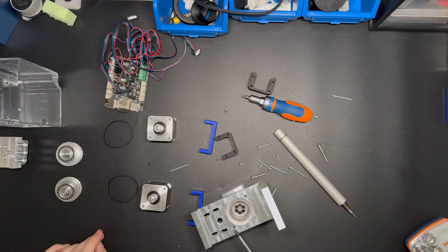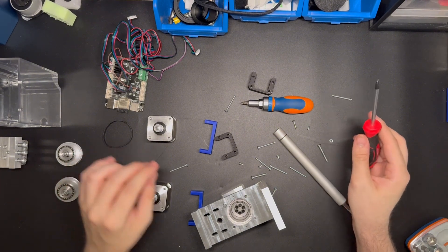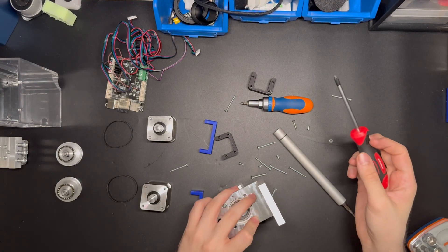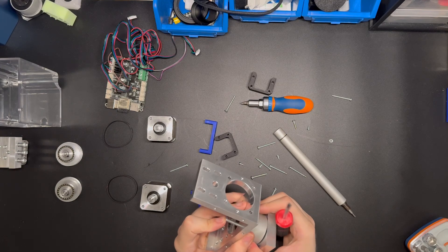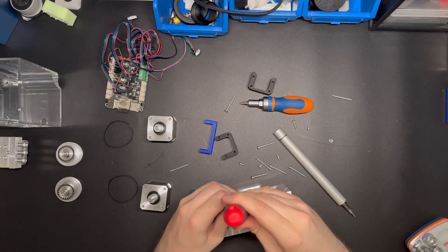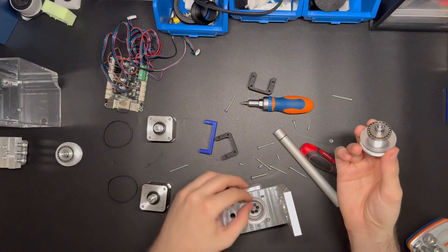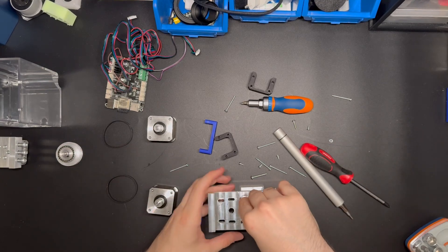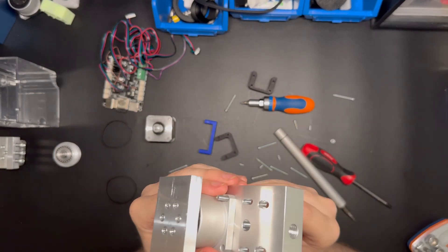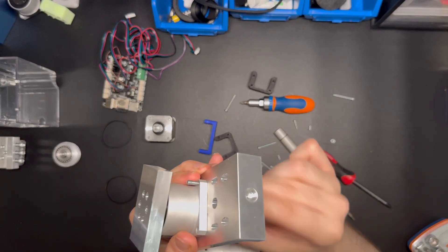For the non-threaded holes you will need to use a bolt to secure it in place. With only two screws everything is absolutely fine because on the mini you won't put a lot of weight, so it's not a problem. Now they are tight. Next, take the pulley and wave generator assembly, simply slide it inside — it will stop and you'll see it works perfectly with no play or problems moving at all.